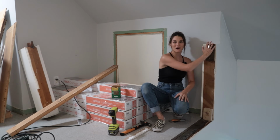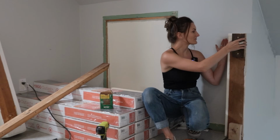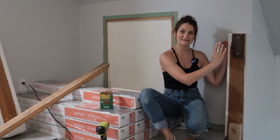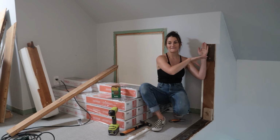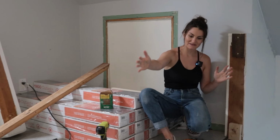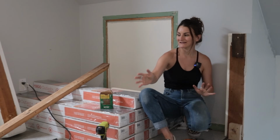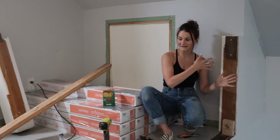I'm actually gonna be popping out this area here a tiny bit. We're gonna be coming off the wall about 10 inches. Then I'm gonna drywall around this and just kind of make a little soffit here. And then that way, when I install the banister, it completely runs the entire length of the staircase and is not a safety hazard. I'm cool with this. This is gonna actually be like a little sitting nook anyway. I'm gonna get started on that.